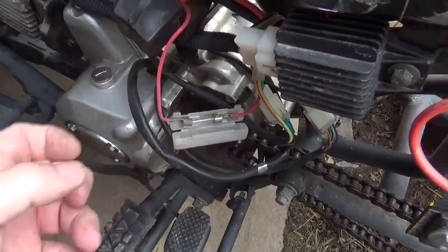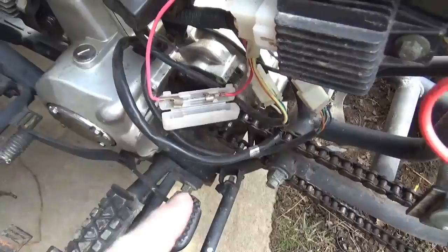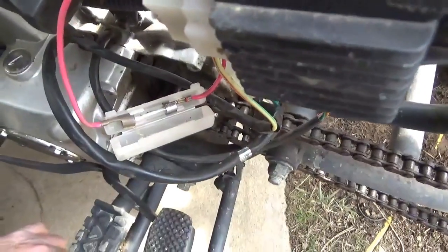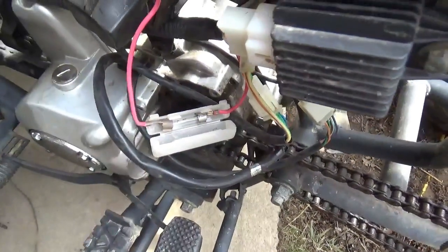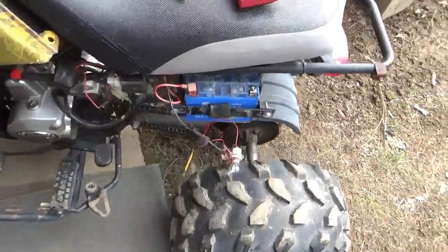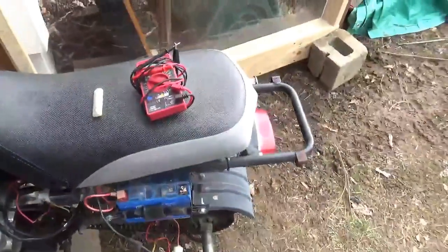The light bulb is in series, so your light bulb is basically your fuse. I still have the blown fuse here, so nothing's going to happen until I replace it or bypass it. Given that the light bulb is acting as the fuse, I'm going to bypass it. Really the right way to do it is to put the proper amperage fuse in, but anyway I'll bypass this and we'll do some troubleshooting - light bulb in series, fuse bypassed.